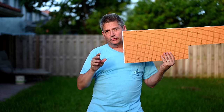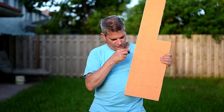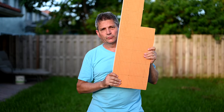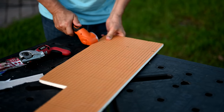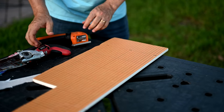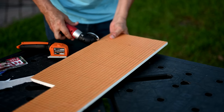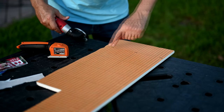Schluter KERDI panel board — this is similar to the KERDI membrane but it's already mounted on a half-inch thick foam panel. These panels are your shower walls, so you don't have to lug heavy cement boards or hardy backer boards. You can cut them with a razor blade. The WORX Zipsnip can't even get into it — the tool just can't reach far enough into the material. So this is not the kind of tool for this product; a utility knife works much easier.